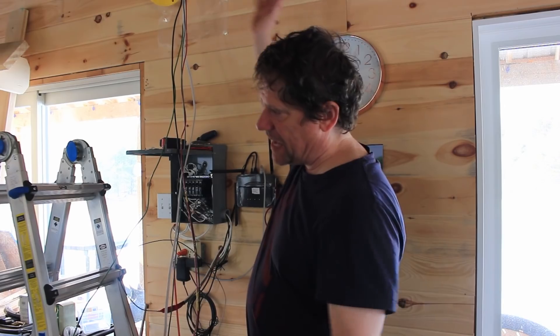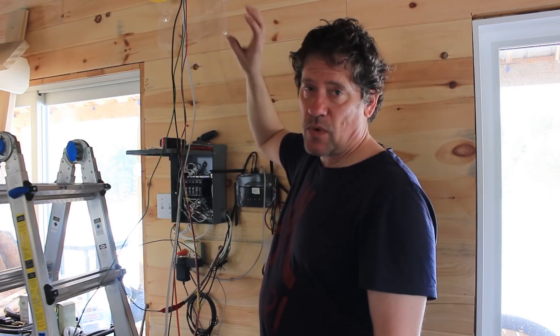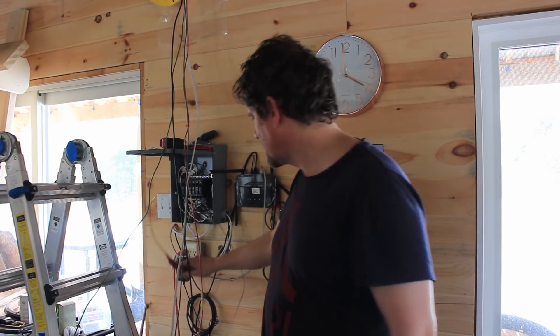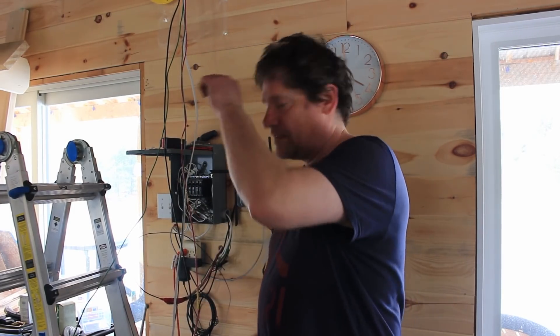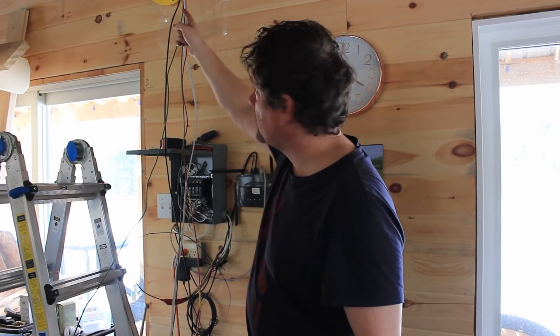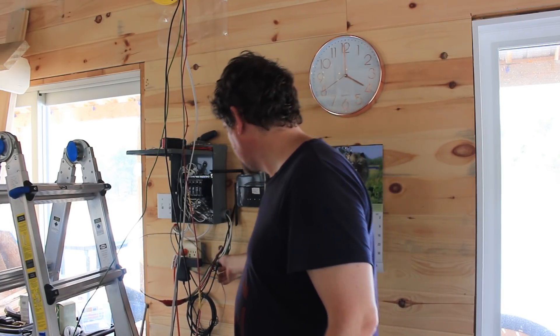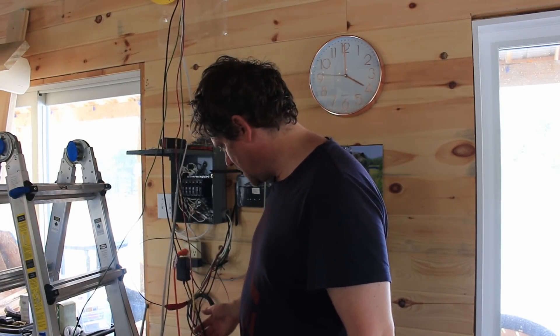So what I did was I pulled everything back out. I drilled the hole a little bit bigger at the top, came back down from the top. But this time I attached the wires to the fish hook at the top and pulled them all down. So I've got them all here now. So now I don't have to worry about pulling all this wire up through here and across the room — I can start up there and pull through and go across. So that's a good thing. I shudder to think what I've done to the insulation behind this wall, but there's nothing I can do about it — it's probably a mess back there.